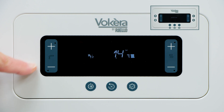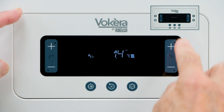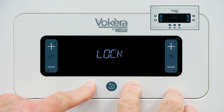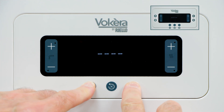Buttons A and B will adjust domestic hot water temperature. Buttons C and D will adjust the central heating temperature. It's possible to lock the display to prevent unauthorized access. To lock the display — locking these buttons — press and hold the two outer buttons until lock appears in the display. That's handy if someone wants to clean the boiler, as locking the display first means you won't accidentally adjust the settings. To unlock, bring lock to the display and press both buttons simultaneously. The display is now unlocked.